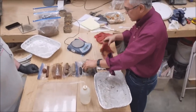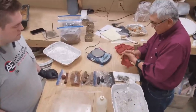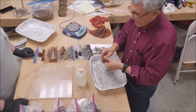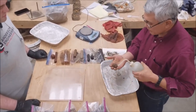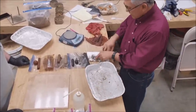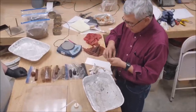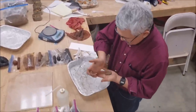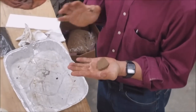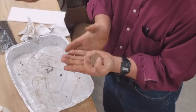So because that had a reaction and that water came out, we know that's a silt. Now we're going to do the same test on the sample we thought was a lean clay. I'm just going to add a little bit more water — this is moist, I'll just add a little bit more so I know water can come out. It's a little bit wet so I'll dry my hands. I'm going to make it into a pad. We got a pad right here, and because it's a clay, clay should be able to hold on to water more and not let it come out.